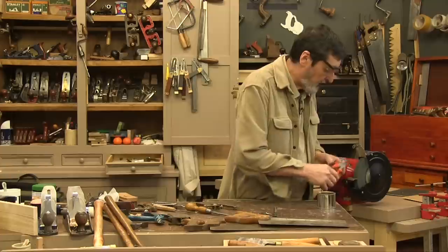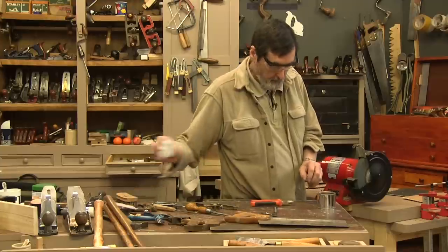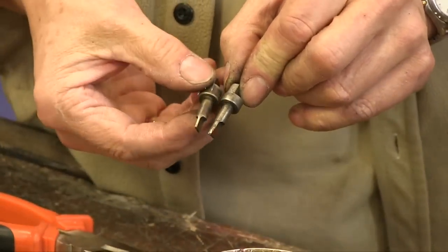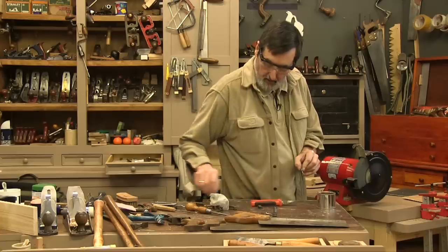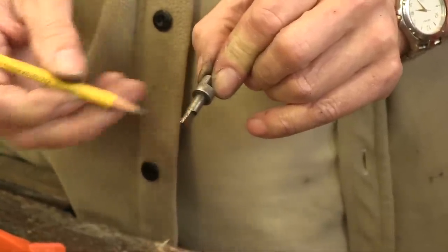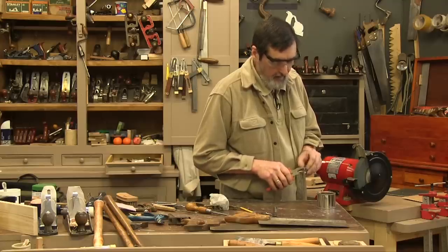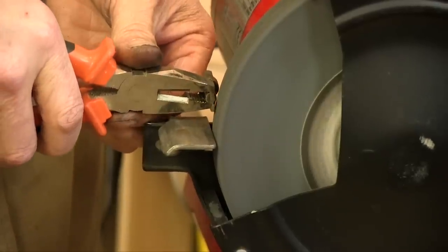So now I've taken it down. I'm tapering in from one side, whereas this original one is cut parallel. I'm going to keep mine as wide as I can right at the base, so it tapers in from both sides — that's going to give me a strong stub to the whole bar. I'm going to do the other side, and I'm aiming to take about 25% off both sides to give me a thin plunger.